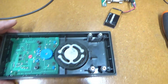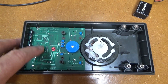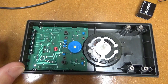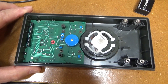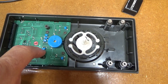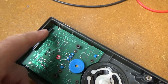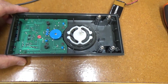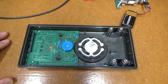In the meantime, I thought I'd fix the display. Under here is where the display is. There are some little zebra strips that connect this board to the display — that's where the bad contacts occur. There are six screws to remove to pull this out: these four right here threaded into metal, and then two over here threaded into plastic. I'll pull those out, get the board out, and see if we can clean it up and get that one fading segment working properly again.